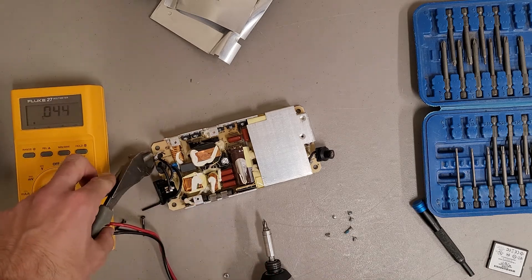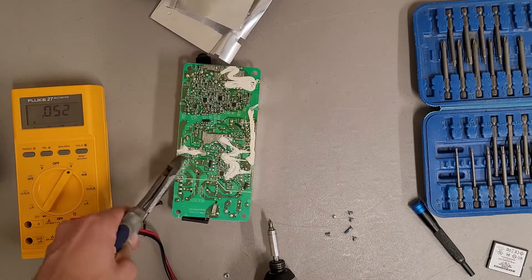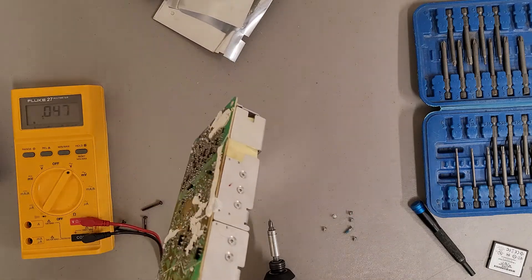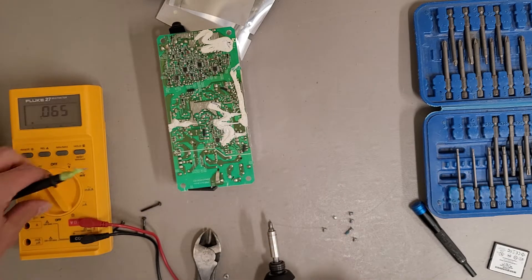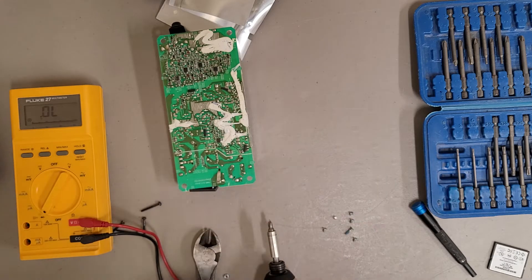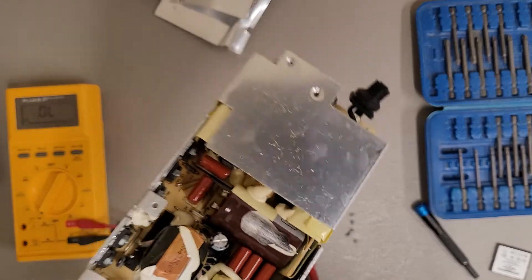The interesting thing I want to see is this heat-shrinked fuse there. The fuse would be these two pins here, but I have to go into continuity mode. The fuse is good. So it's kind of a mystery what died.